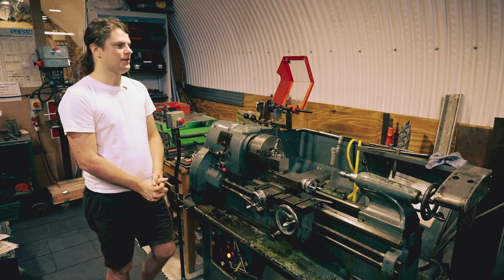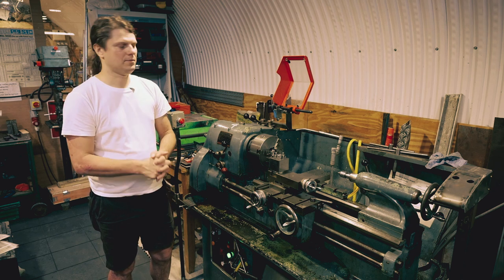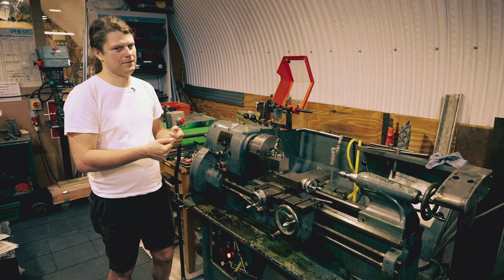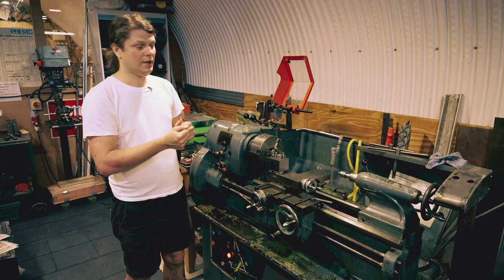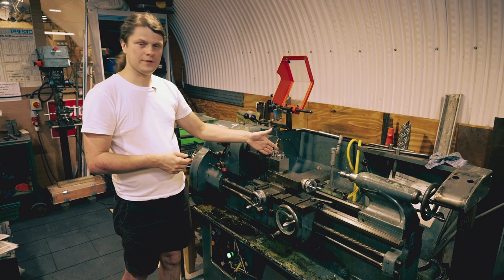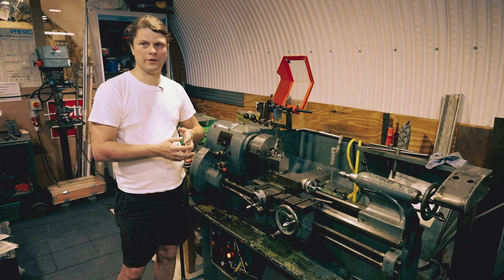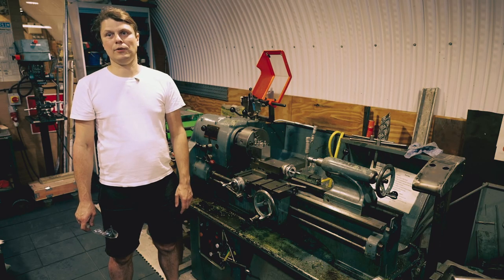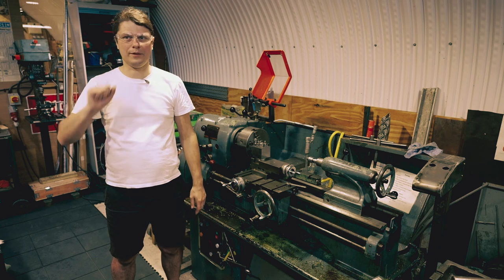The third main risk is burns. Burns are not specifically dangerous as such. Basically, when you cut metal, metal gets hot — it shouldn't get hot on the lathe. If it gets hot, you're actually doing something wrong because if the metal gets hot, you're losing precision. But it sometimes does, and the problem is when you touch hot surfaces, you have a jerk reaction and hit yourself on other parts of the machine that are protruding and can be sharp. When working on the lathe, use protective glasses — you can use your regular glasses or the ones we have in the metal shop here.